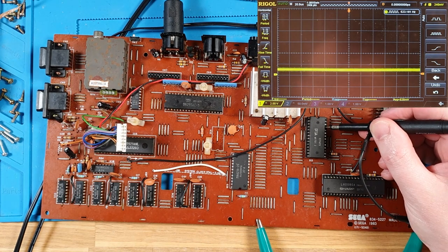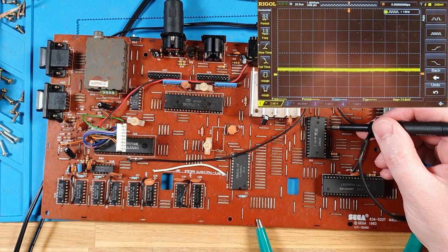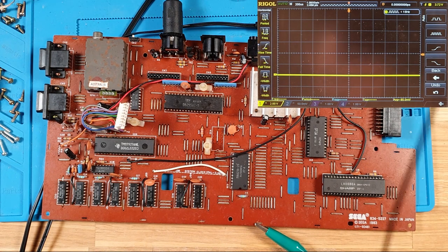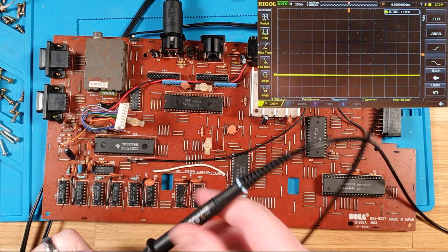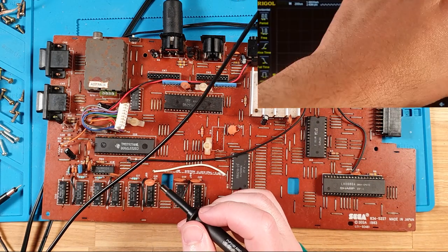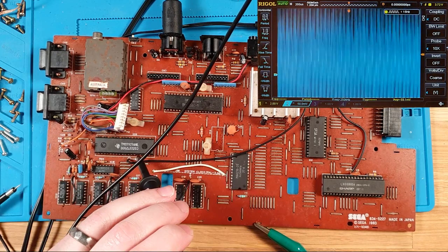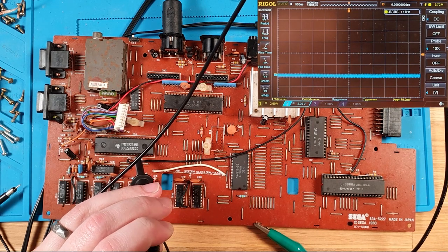That is interesting. Hang on. Oh, that looks terrible too. So what I'm going to do here is set my trigger on the blue probe, and put that to the chip select of the video here, which is the CSR pin 15. Let's enable our channel 2. Pin 15, so this is 20, 19, 18, 17, 16, 15. So there we go. All right, we are constantly low.